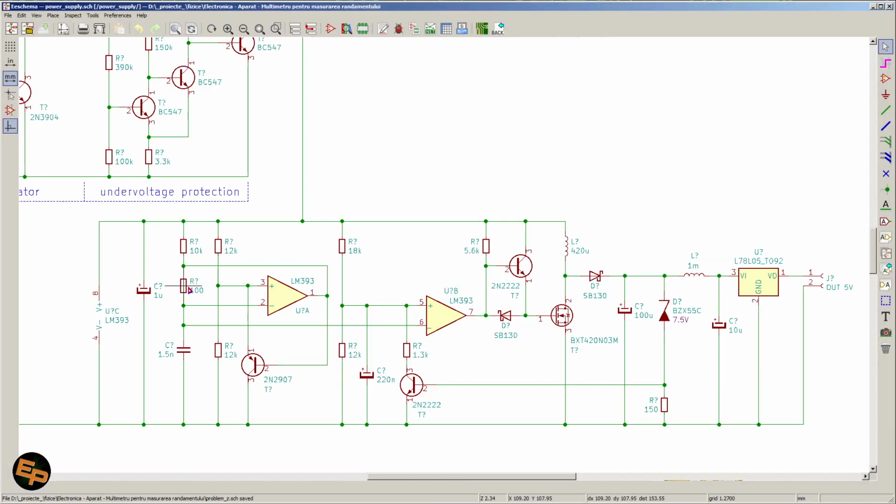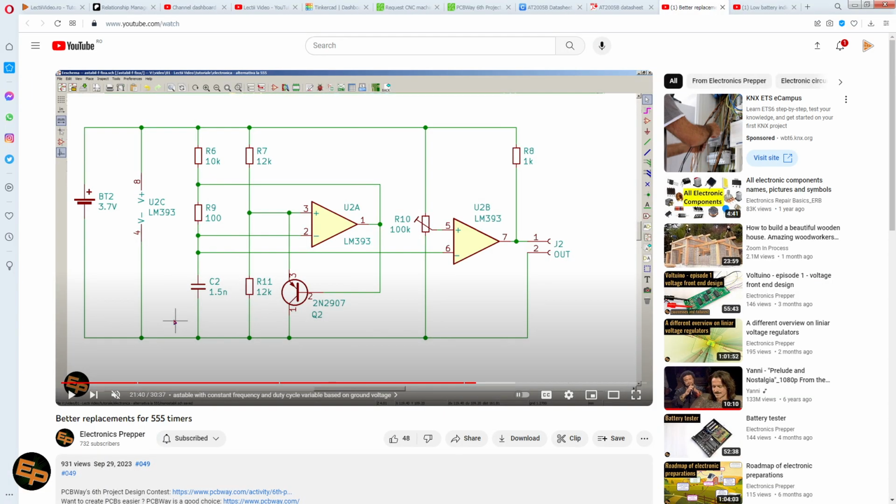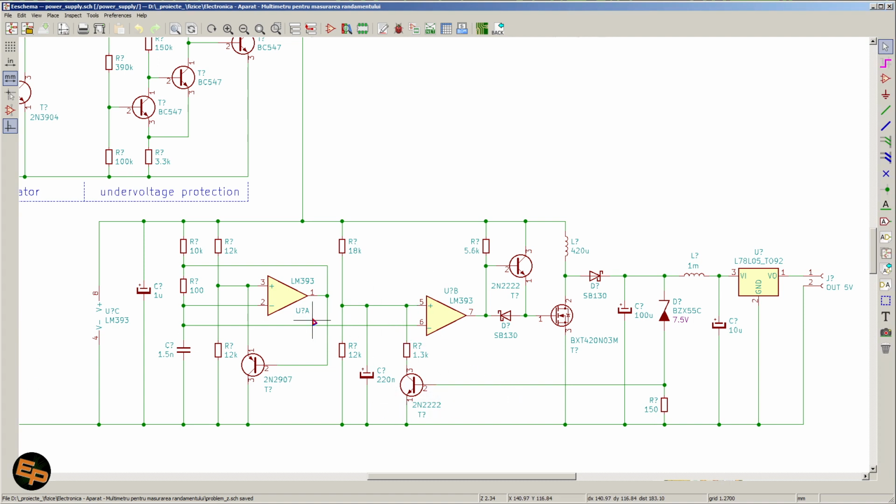Well, the beginning of this DC-DC converter is essentially that, because we need to generate a square wave to be able to switch our inductor. I have used such a circuit with one comparator, and all the associated components. Because I've created this dedicated video, I'm not going to go into great details about how it works. I will put the link in the description as well, so that you can jump there and analyze this particular circuit before moving forward. So I'm generating a roughly 100 kilohertz signal, feeding the more or less linear ramping. It's not quite linear, but anyway, the ramping voltage of the capacitor.